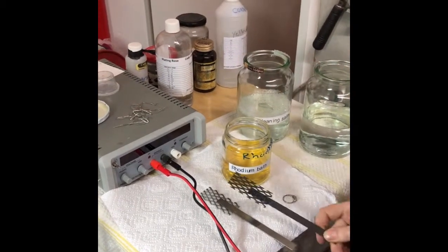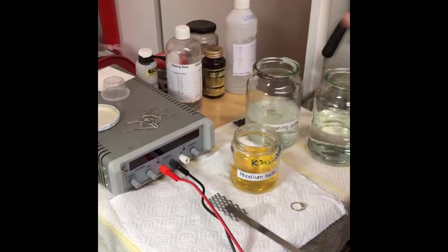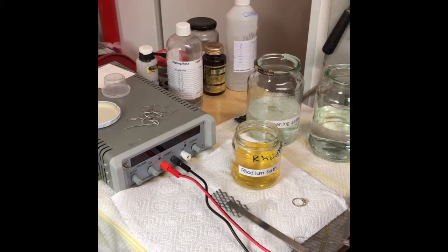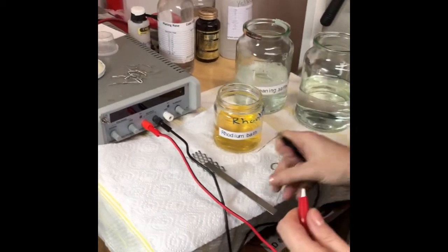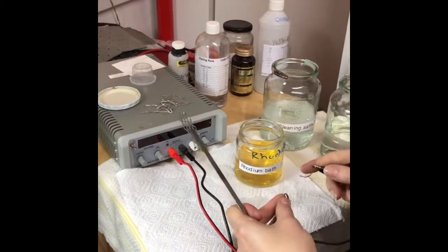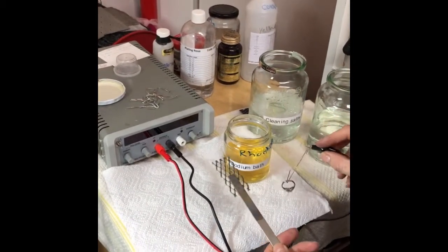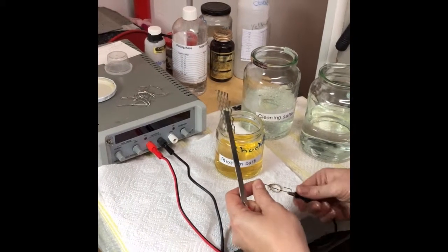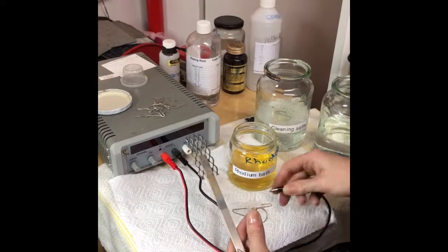The titanium anode is used for rhodium bath solution. You also get a black titanium anodized anode, and this is for rose and yellow gold plating. The principle stays the same regardless of the plating you're going to be doing. You've got a red and a black cord — the red cord holds your anode, and your item is always on the black cord. I use a simple paperclip to hold it on instead of clipping it straight onto the item, where it won't plate well and could mar or scratch your item.